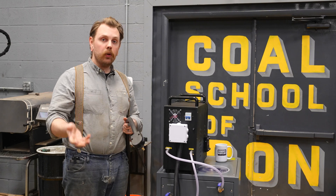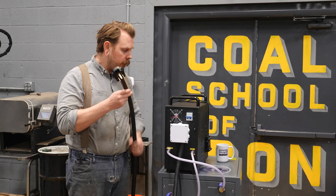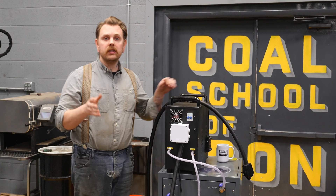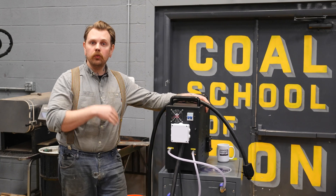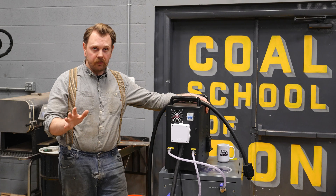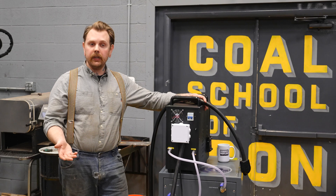For the 25 kilowatt especially, you have to have a dedicated 50 amp service to this unit. Because of the power at play here, it's very sensitive to any fluctuations. We actually found that even going one wire size smaller, even for this eight-foot lead, was enough to affect the performance of the unit. So make sure you've actually got 50 amp service run for the dedicated outlet this machine will be plugged into. It is totally 220 volt single phase.